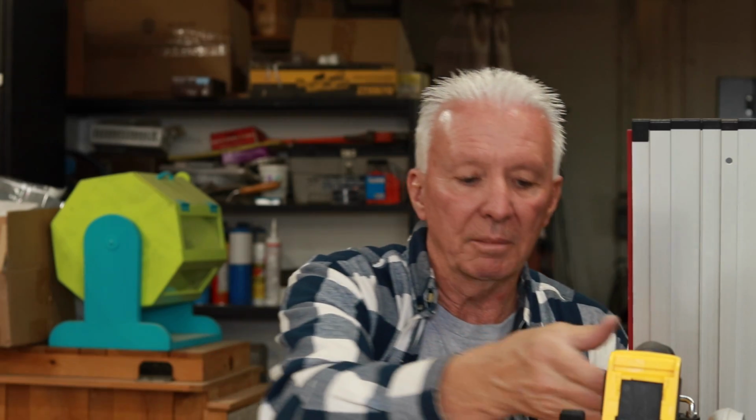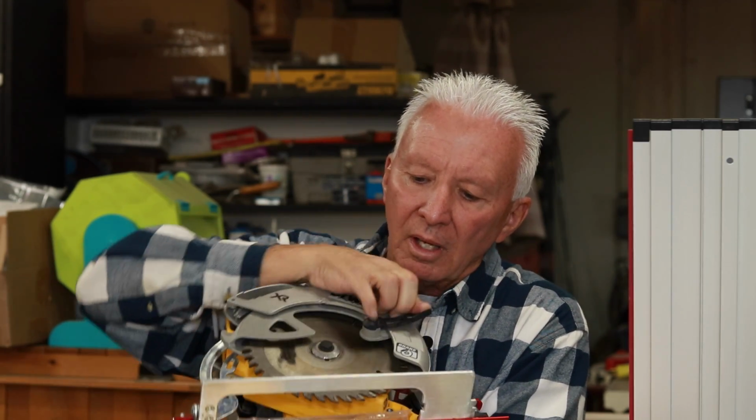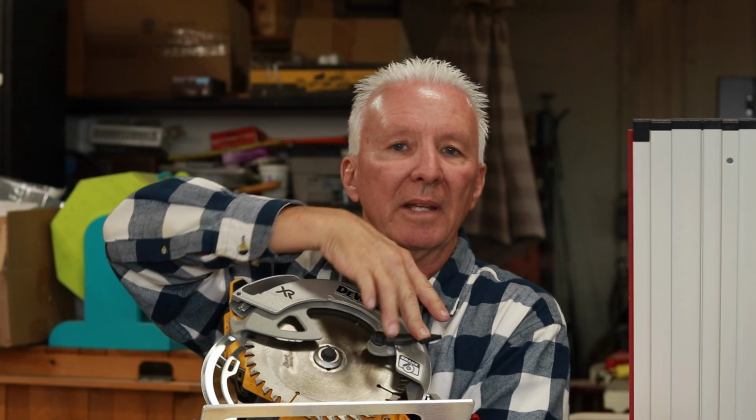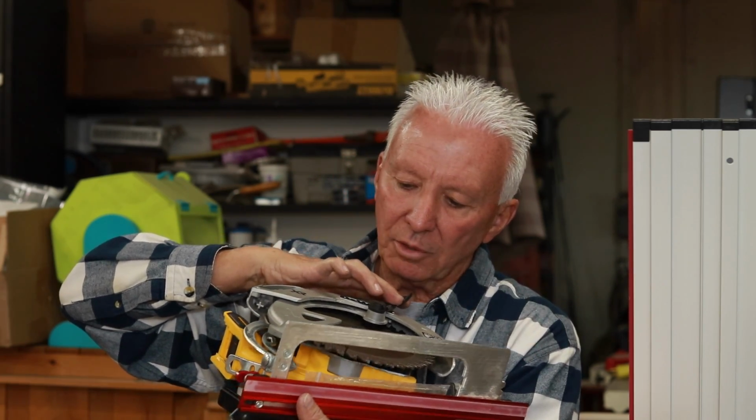It's just a very aggressive blade to cut through construction lumber, basically, not for finish carpentry, for good finish work, for a nice smooth edge. And when I switched it out to one of the blades that I had, basically this blade came from my stepfather's construction company. We used to buy good blades for our circular saws, and we have them resharpened. They have carbide tips. I think this is a 60 tooth. Pretty sure, I have to go back and look at it.